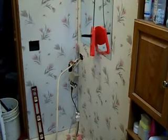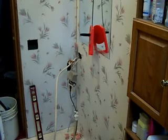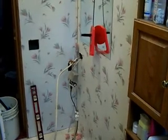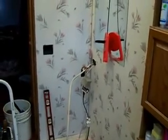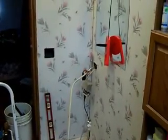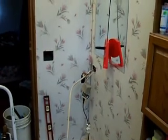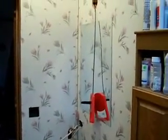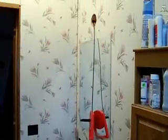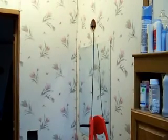The electrical outlet used to be right at the back of the sink, but the new sink backsplash is going to cover over that hole. So I'm going to wire in a switch and the GFI outlet into that rectangular box on the left wall. The switch is going to go up to the top where I have a four-inch circle hole drilled, going out to a light.